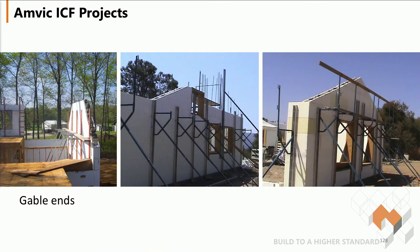We have gable ends here. One of the things with gable ends — we used to spend a lot of time forming on both sides, then have plywood ready, so you'd vibrate, put the concrete in, vibrate, slap a piece of plywood in there and move on up. The photo on the left shows we learned we could use the webs as little dams. We'd vibrate the wall, add a little extra concrete to the very top, let it sit for about an hour, go back in and screed that off. It probably saved us four or five hours of two men framing that up.